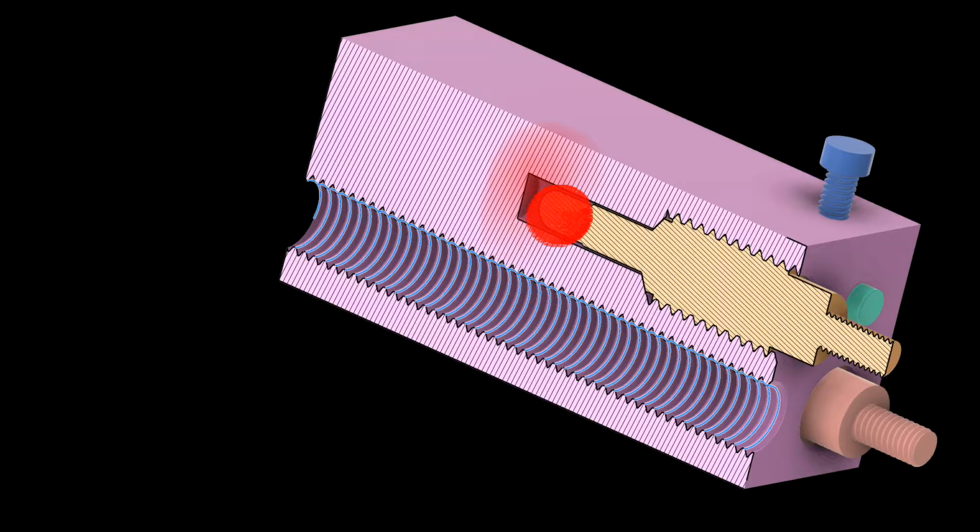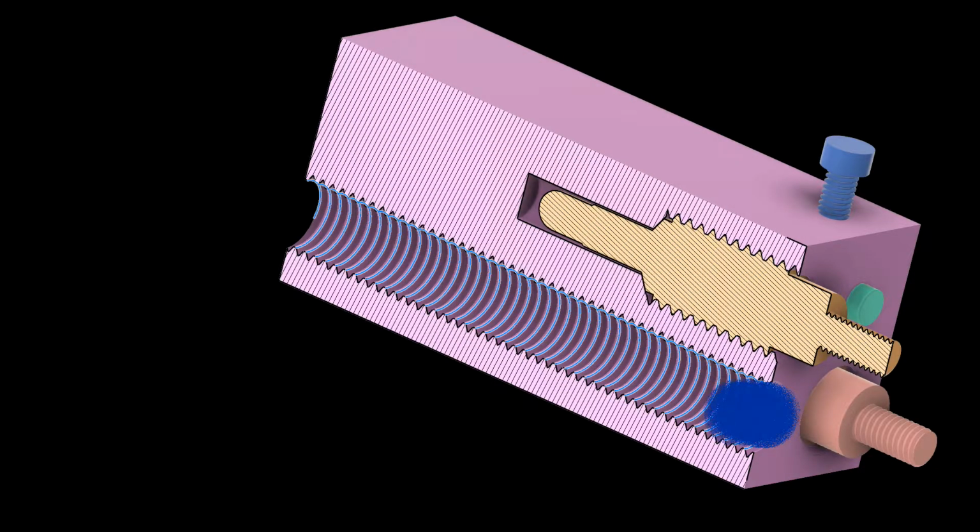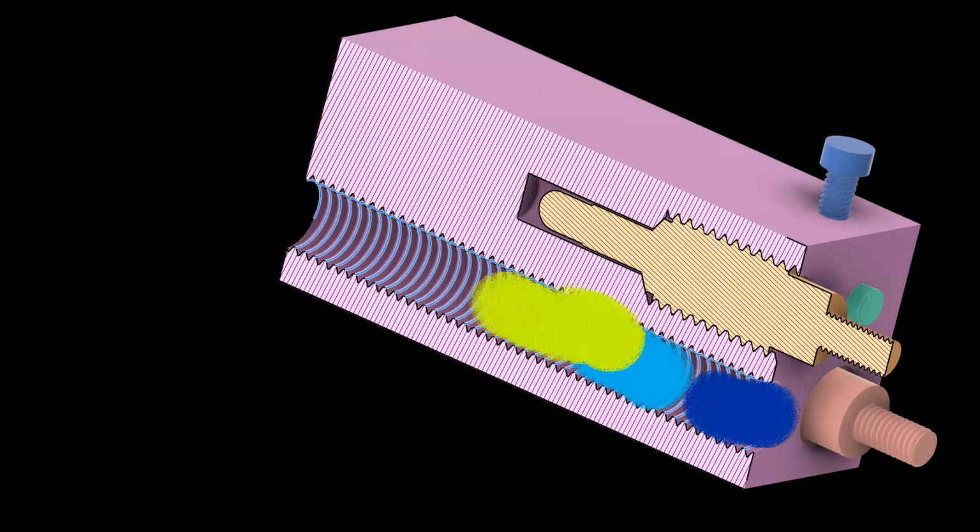So same thing, glow plug heats up, but rather than heating the oil up directly, it heats the block, and the block heats the oil. Now I said in the last video about threading the depth of this tube. The larger surface area gives a better contact to the oil and hopefully just heats it up. Oh, this is really crappy graphics of this, I've got to apologise. But you can see as the oil travels through, it conducts the heat out of the block.